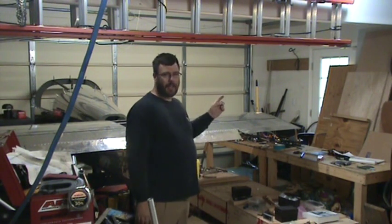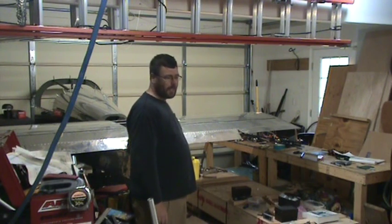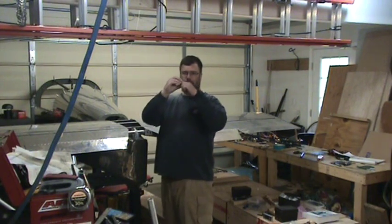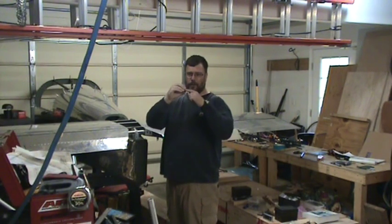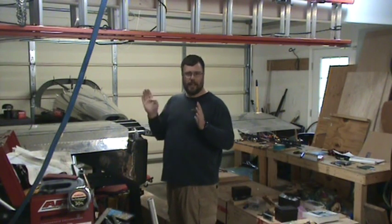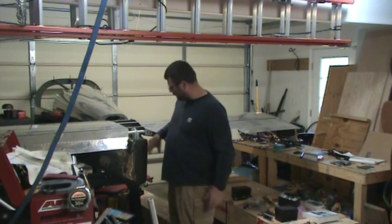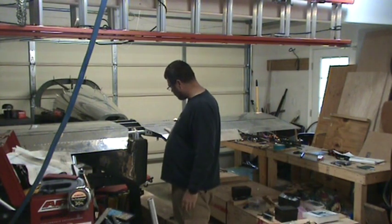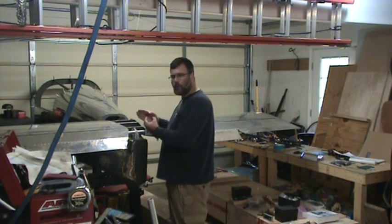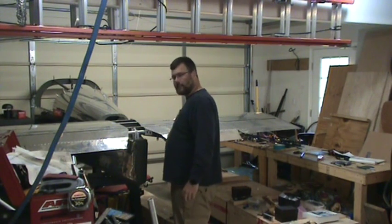adjust this, and I think first area I'm going to adjust it is here on the cable mounts, because if I screw that out one turn, it'll switch the threads, because it's not really halfway. There's 8 threads on one side, 9 threads on the other, and if I switch it for 9 threads being on the back, or on this side, that will pull the whole cable assembly inboard a little bit and cause this to retract